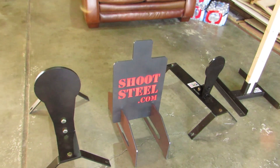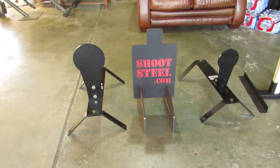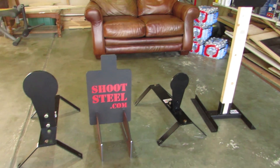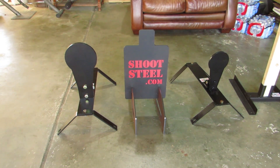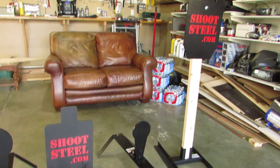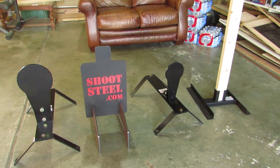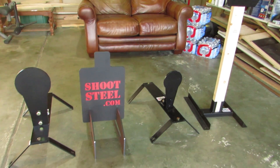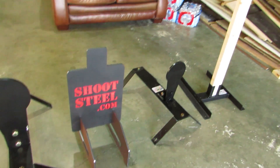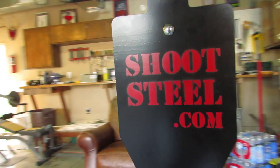Shooting AR500 targets is going to be better anyway. With mild steel you get a lot of cratering over time, which makes it difficult to spot exactly where you're hitting even if you keep it painted. Also, peripheral splash can make bullet fragments not go in a smooth direction all the way around 360 degrees. If it hits a divot a certain way, it might appear as if you missed off to one side. You get a lot of asymmetrical peripheral splash which can be difficult to spot. AR500 is going to stay smooth for a long time and should be really good for applications where you're doing a lot of shooting.